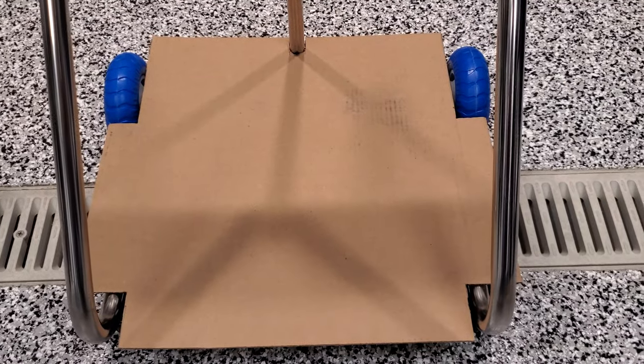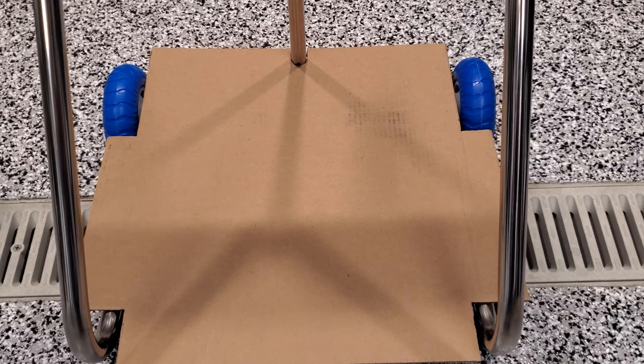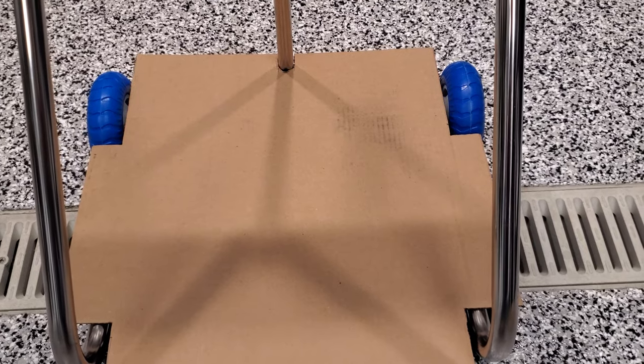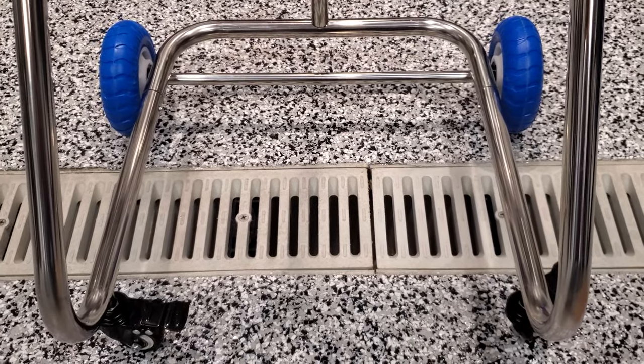I ordered a three-sixteenths by 20-inch by 20-inch 304-grade stainless steel plate — about 22 pounds. I need to make a few notch cuts and contours so it drops into the base. I've made a cardboard mock-up, and we need accommodations for the tires and the radius that brings it back up. Using the cardboard as a template, I'll drop it on top of the stainless and use it to make my stainless piece. Off to the drill press.